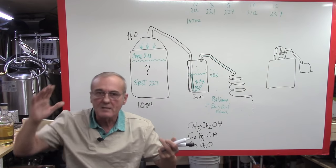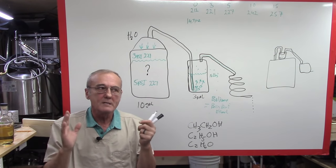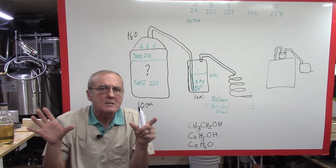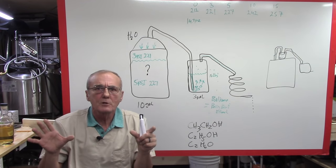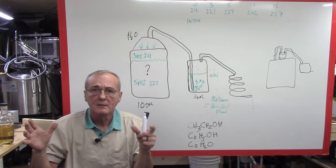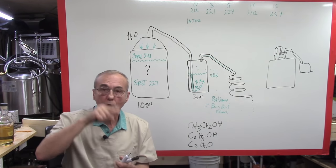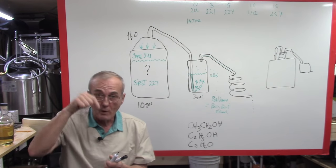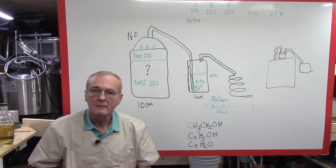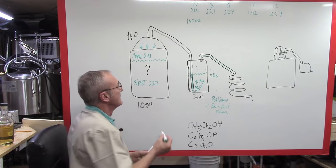See how this all makes sense when you put it in perspective and you try to understand, well, what is actually happening in the very beginning and why does it escape as a vapor and what controls that? Again, pressure and kinetic energy being temperature. Now, pressure and temperature are proportionate, meaning when one goes up, so does the other, okay? When one goes down, so does the other. Keep that in mind, because here is another drawback, not a drawback, but something to really, really be attuned to when you run a thumper.